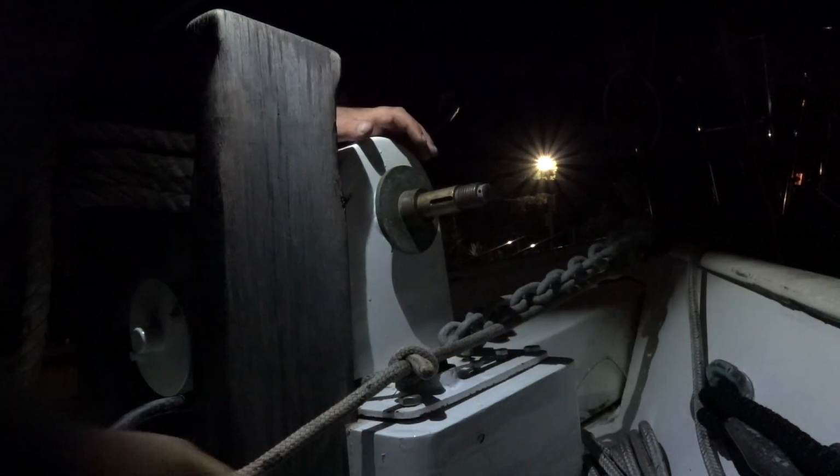All right, working in the dark again. So, sanded the brass drum, and I think it'll work. What happens is the drum rides on this surface here, and then the actual drive plate drives off this surface via a key. So the drum is freewheeling unless, oh, look at that, took a big bite out of that. This thing is tightened down on it, so it makes it really easy to take this thing apart.